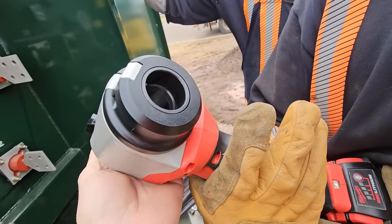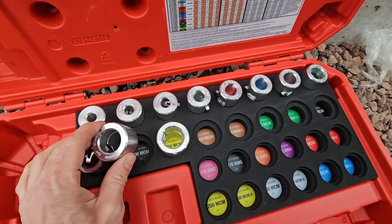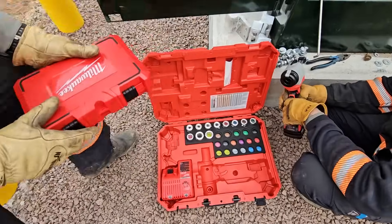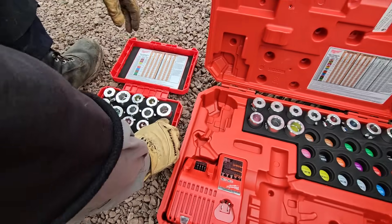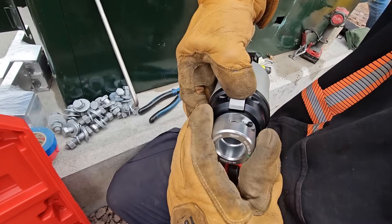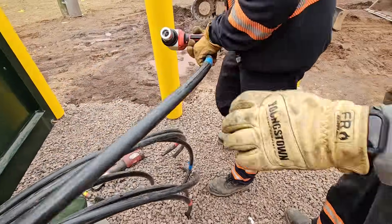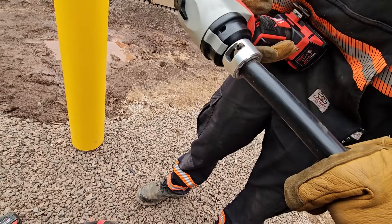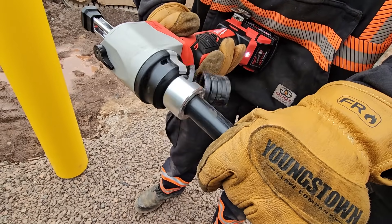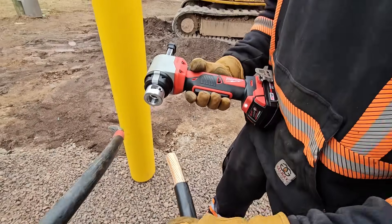So that set the depth gauge for the insides. Then we need a die - 600 MCM aluminum. Open it flat so they don't all fall in. There you go, 600 - copper. Just push on that, push on the gray thing right here, and it should lock in the hole. Oh my goodness. Yes sir - that is a game changer, that's sick.